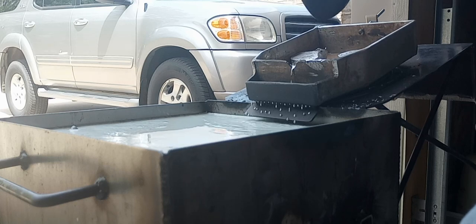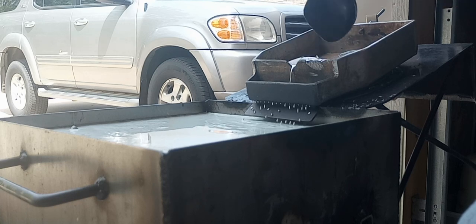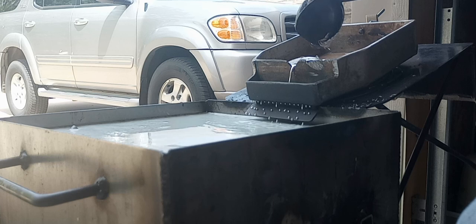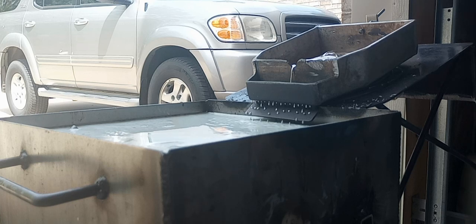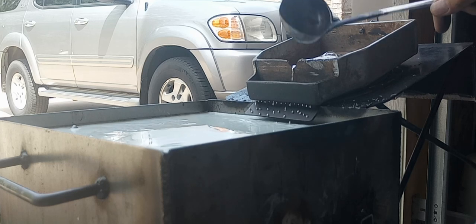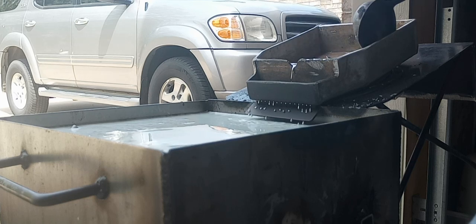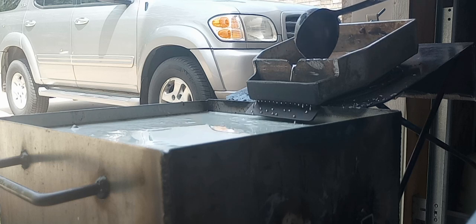These are number fives. Looks like I've got plenty of distance from the fall because they're not streaming. Now, I drilled the holes 31/1000 of an inch for these drippers, so that should be fives, because you drill 29/1000 for true sixes, which is going to come out about 110/1000 for six. And I've got 16 drippers running here. And I think that's about all I could run with number fives, and keep the lead flowing.